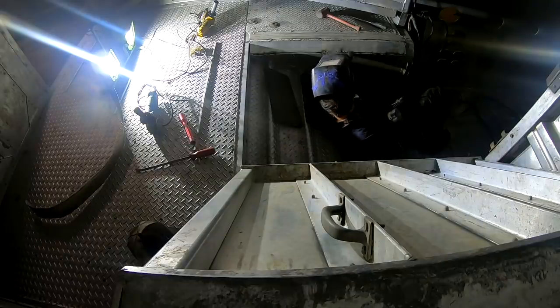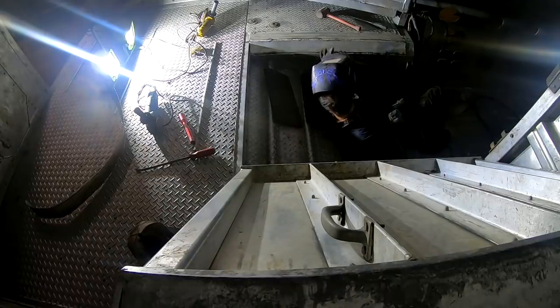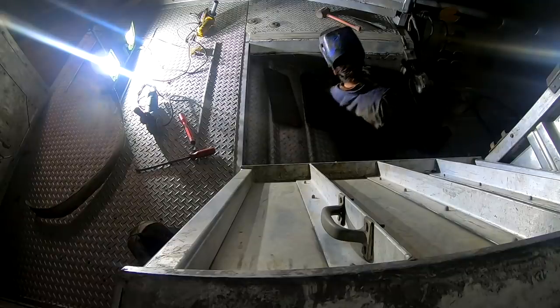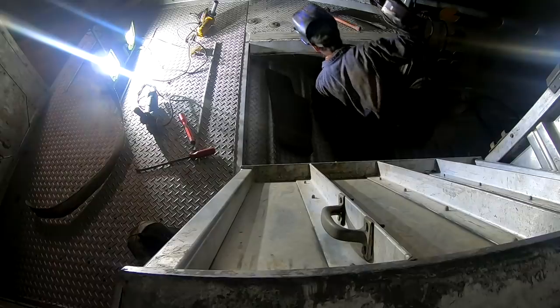And if you do this and you make two passes with this aluminum, take a wire wheel. I got a wire wheel and an air grinder here. And I'll go over and clean it again before I go over the next pass with it. This aluminum's just really, really touchy. I mean, really touchy.